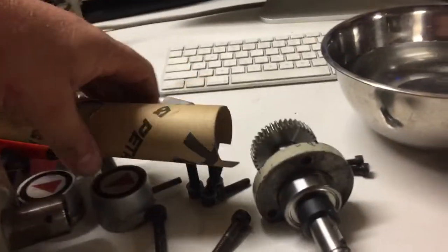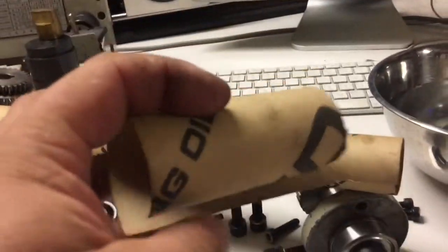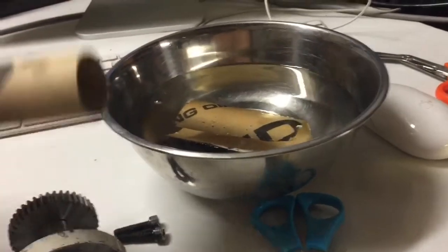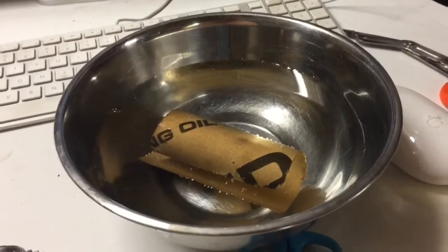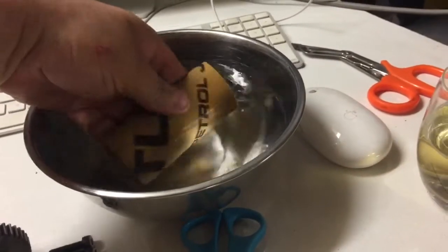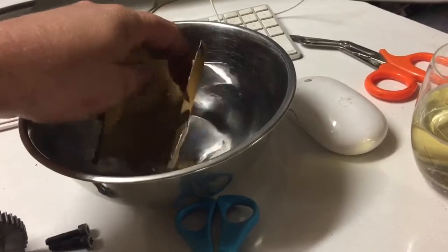But for those of you who have not used gasket paper before, you might find buying it a bit of a challenge, and trying to cut it a bit of a drama. But if you soak it in some water first before cutting it, surprisingly all the difficulty goes away and you can lay it out flat without it cracking, and happy days.